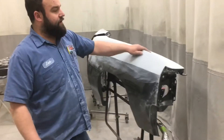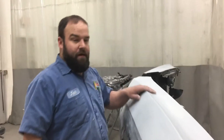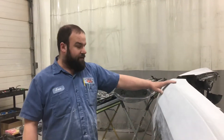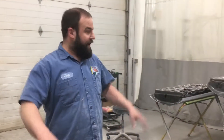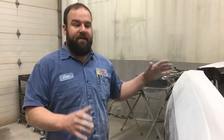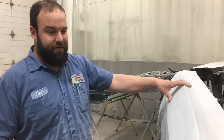A lot of the timbers had come across these fenders in a few spots and smashed all these nice lines down. So we had taken them off the car, put them on a bench, hammered that line all back straight, hammered everything out. Very minimal body work done after that. All the hammering went very well on the fenders to get everything lined back up. The hood itself had a big smash in it — pounded that out, straightened that all back out. Basically, we wanted to use the fenders and hood that was on the car because they were previously fit. If you buy a Chinese fender or something like that, they don't fit. So these were all fit to the car, so we wanted to reuse them.